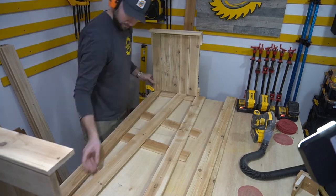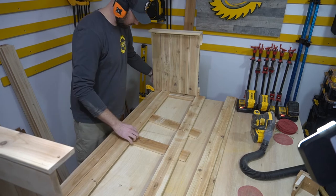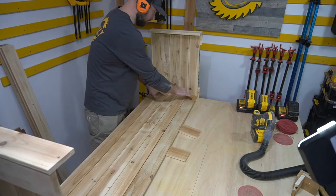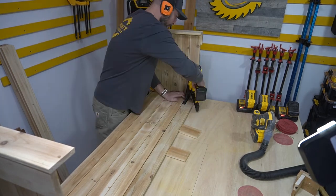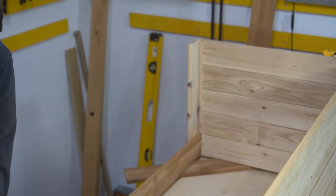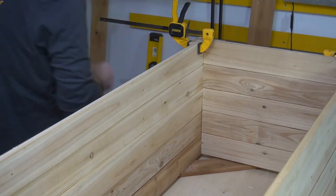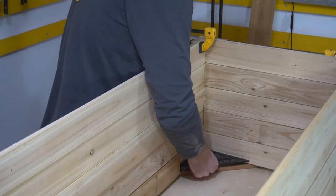From here we're basically ready to start getting it glued — lay the glue and slide it into place. Wipe any excess so cleanup is easier and you have less sanding. Do a quick test with the square and tack it in. Now the tip goes back on the other side. For the last wall, spread the glue and slide each plank from top to bottom. Once that's in place, use the brad nail to tack it in and you're good to go to the next step.